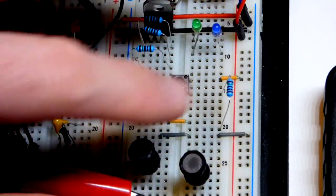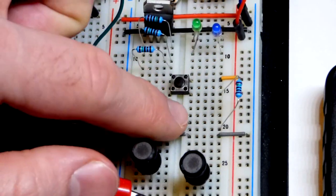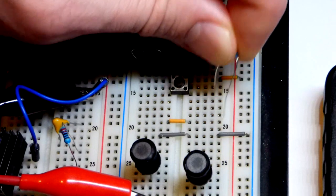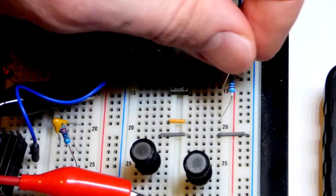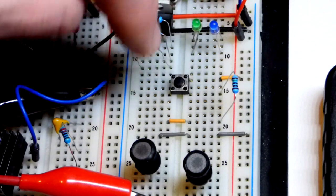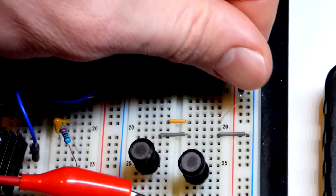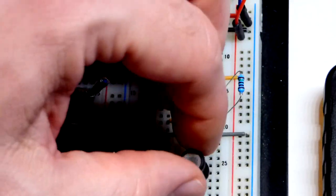We took apart the circuit and we're going to put it back together. I noticed something that made this perform worse than it should have — that resistor was right next to the jumper. We actually want to move the resistor to the orange jumper. We're working with five volts and I want a fair amount of current, so I'm using 150 ohm resistors. All of these resistors are 150 ohms, and they're providing probably about 25 ohms as well, helping limit current a little bit.